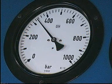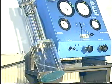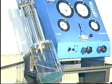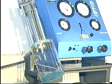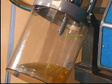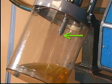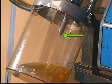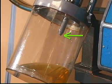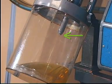Increase the pressure until it is about 50 bar below the actual opening pressure. There will always be a certain amount of oil flowing from the return oil pipe when the fuel valve is full of oil and pressurized. Oil must not seep from the fuel valve nozzle holes until a pressure of 50 bar below the actual opening pressure is reached. If oil does seep from the fuel valve nozzles, see procedure number 909. Lapping of the internal seatings is not acceptable.